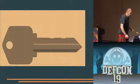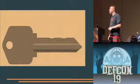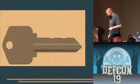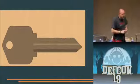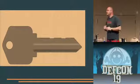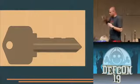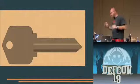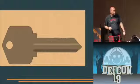So what we do then, at that spot where we see marks, we take away a bit of material. The key is a bit, and key was not pun intended. It wasn't. Because if you know your brand of lock, then you know what the possible key depths are. And you can start off with the highest possible biting. If you file your key off to that biting, then you know you have to go one step down, and that speeds up the process considerably.